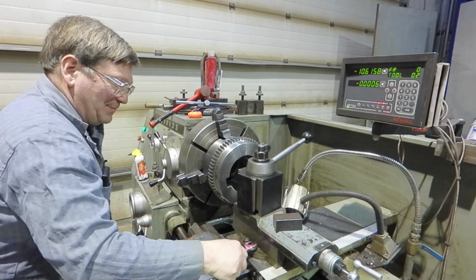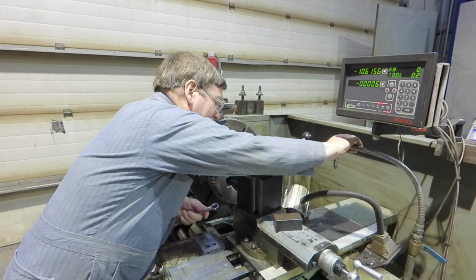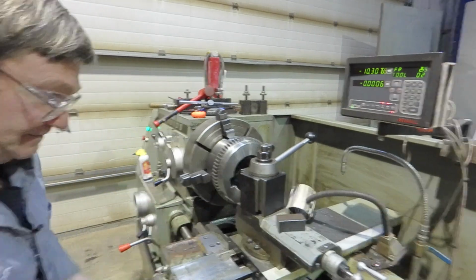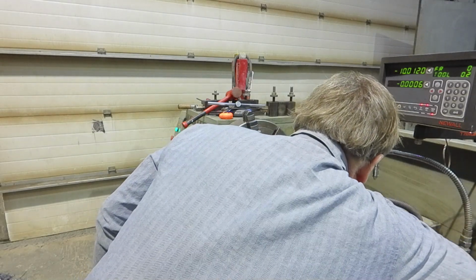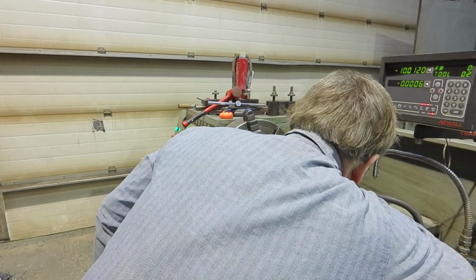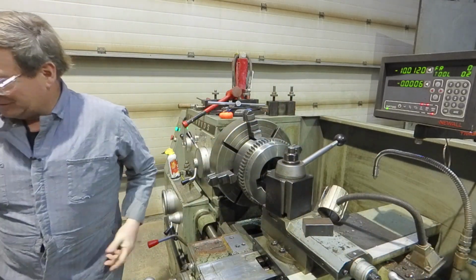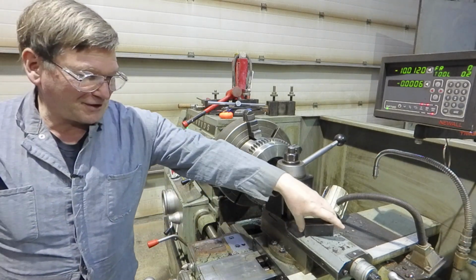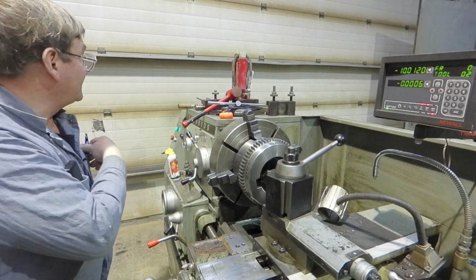If we were setting a taper that had to match with another taper, that would be a whole different thing, and we would go for the extra, making it accurate. But it really isn't going to matter in this place if, out of a movement that we make, we're off by a micro inch, which is a millionth of an inch or a thousandth of an inch. It doesn't matter. It doesn't have to be that accurate.